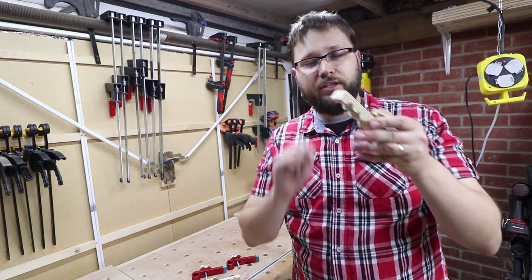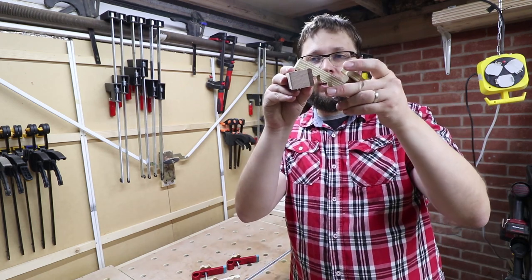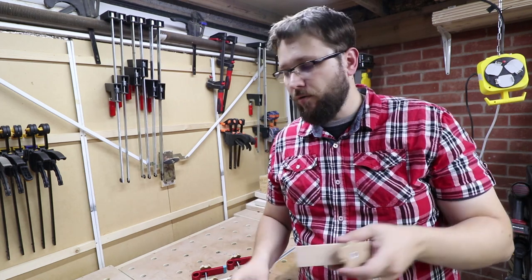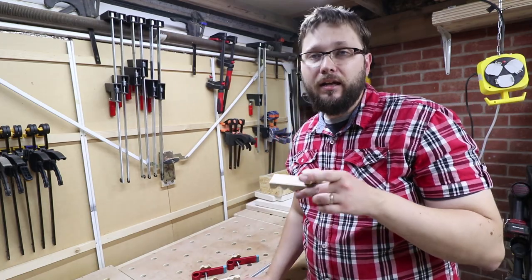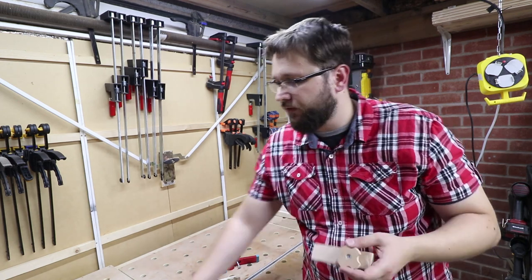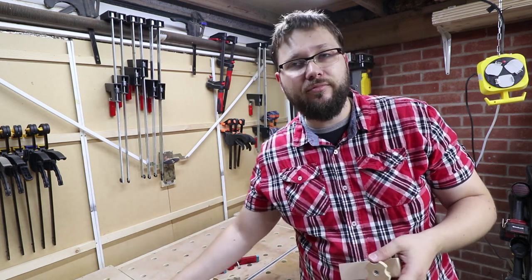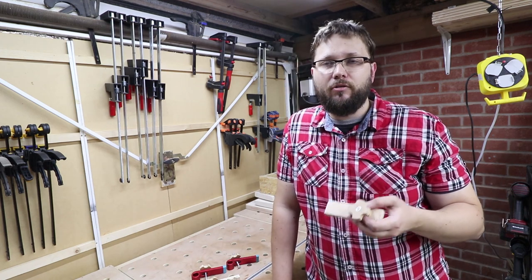Now the notches in this particular type are basically, if you're clamping a piece of wood, the notch would go over here, or depending on what angle you are. So in theory, it would hold your piece of wood a little bit better. And as you've seen, the star knobs are ever so easy to make and so inexpensive. When you're trying to buy the original plastic ones, they can be fairly expensive. And in this way, you're just using some scraps, and more or less that's it.